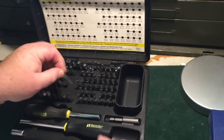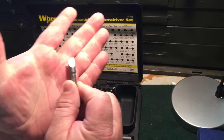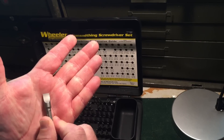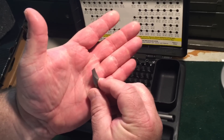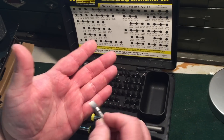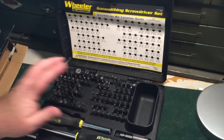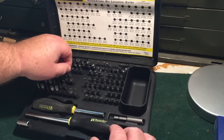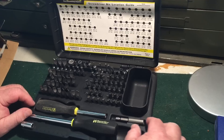The point of this is that these bits are hollow ground, which means they're not wedge-shaped — they flatten out at the screw. For gunsmithing that's what you want. You don't want your typical wedge. A typical bit would just be wedged from here to the tip, and when you stick it in the screw head it might ruin it. The reason there are so many bits in here is because you want to use the one that fits perfectly, so you won't damage the bit or the screw head. It will apply the force in a proper way.